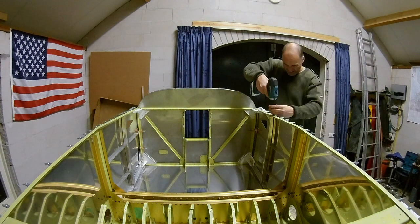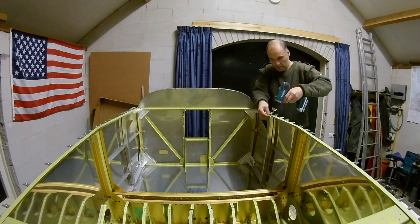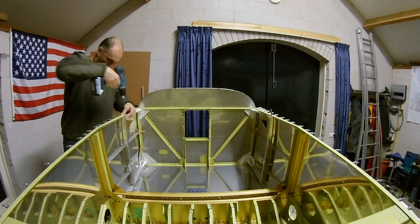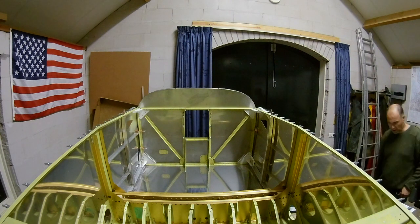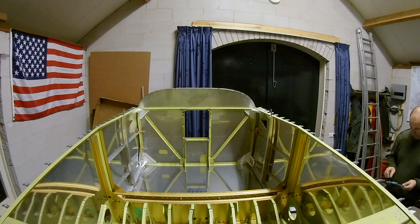Sometimes I use a light so that I can better see what I'm doing on the inside. Now I'm attaching the bulkhead to the main longeron on the top side. My drill bit was dull so I had to drill for a long time — I figured it out and replaced the drill. I drill thick material with cheap drills so I don't make my good drills dull, and I drill them a little bit smaller so I can make small adjustments.